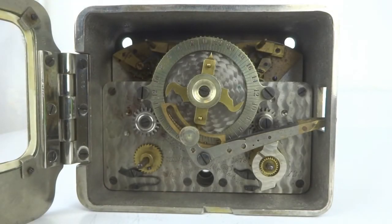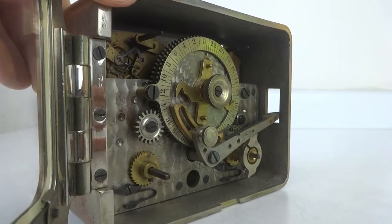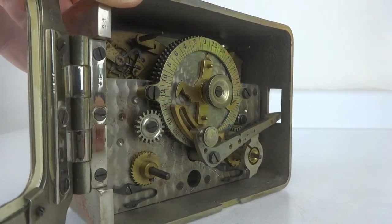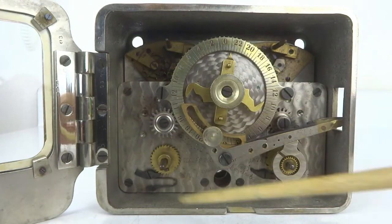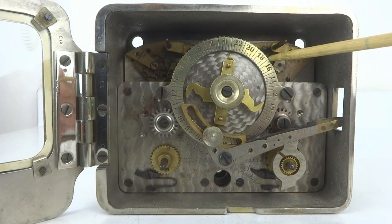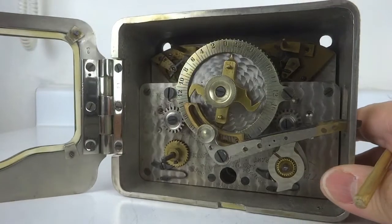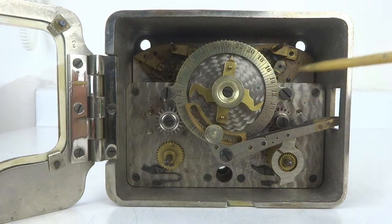Now here we have a Beard Type 2 lock, and if you turn it sideways, one can see that there are two cogs, one here and one here, and that is shown in their updated patent. How this is driven is that you have the two gears here and here, within a single E. Howard time lock movement, and one is attached to the outer cog and the other is recessed here and is attached to the inner cog here. Both of these cogs are now in turn attached to a spindle with a ratchet, so that should either one of these stop, the other one could still drive the cog.